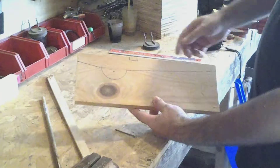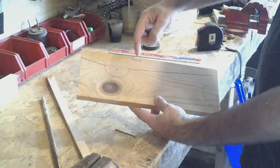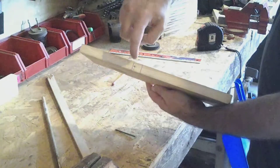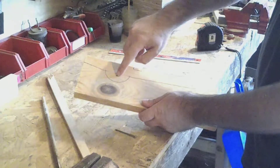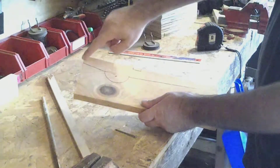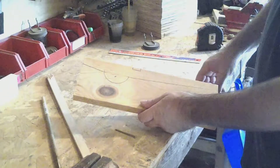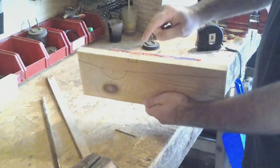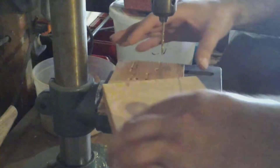I've got the basic design made out. Here's our notch on the top — it's going to hold the string. Our release will be drilled through here and stick out the bottom, and our trigger will be fulcrumed on this and stick out this direction. We'll just remove all the rest of the body. So let's start by drilling this hole and this hole.